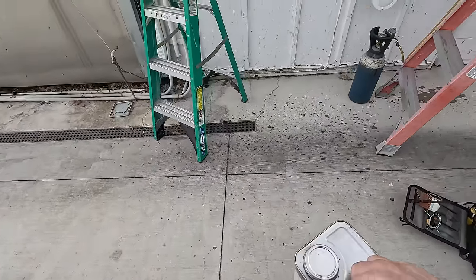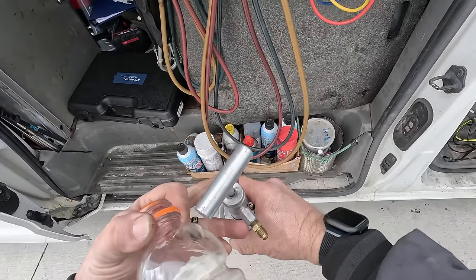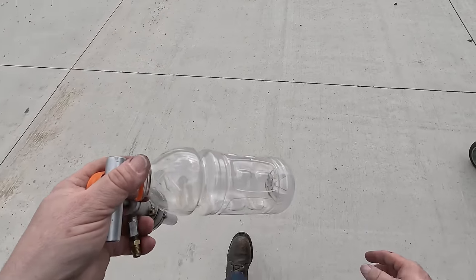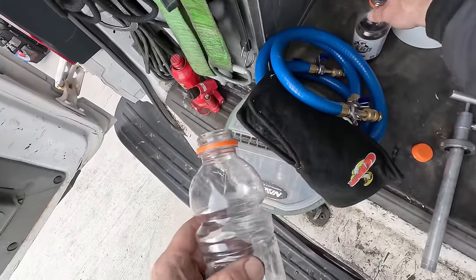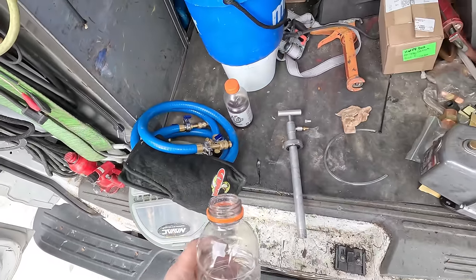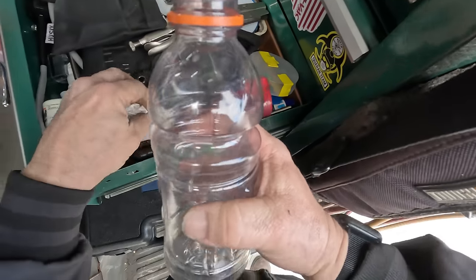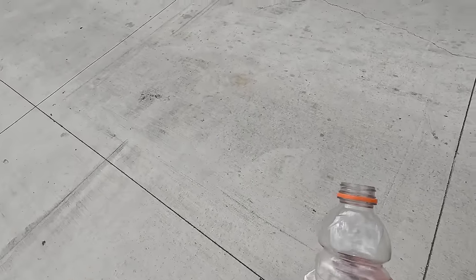We'll get the pump out and pump it in. What I normally use if it's a bigger compressor is my coffee can setup — that's usually what I keep my pump and stuff in, it just makes it simpler. We're gonna wipe this out, make sure there's no moisture in it, and fill it up with oil. It's just a lot easier than trying to do a lot of measuring. I'm all about keeping it simple and effective. PoE oil — you can't get all the moisture out of it anyway. That's what your filter dryer's for.